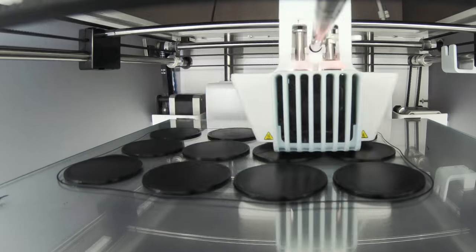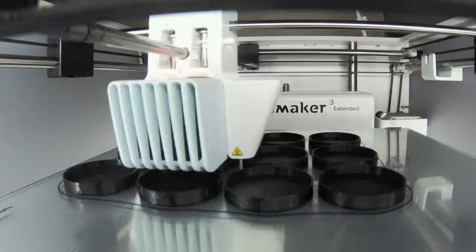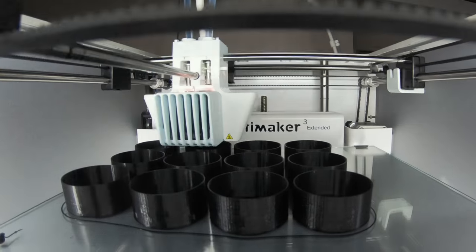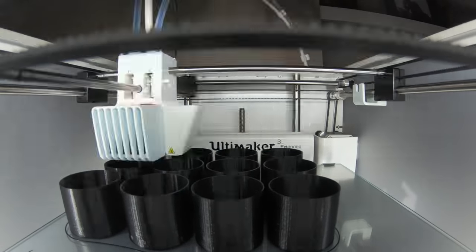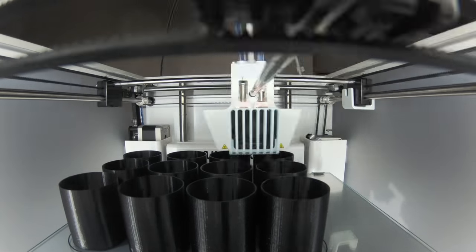I was coming up with all kinds of ideas using PVC pipe and things like that, but I have a 3D printer, so I jumped into SketchUp and modeled up a quick cylinder mold with an inner diameter just slightly larger than the diameter of the spirals, and then did a test print to make sure it was watertight — which it was. After that, I printed a bunch of molds, about 24 in total, and then could get to casting.